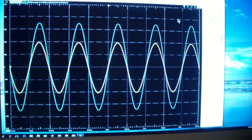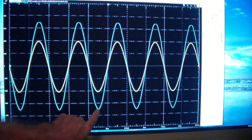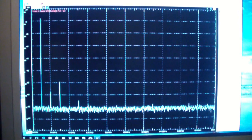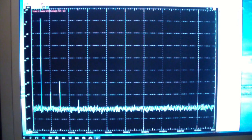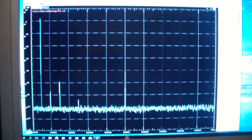Here is the Analog Discovery back to local feedback. Now I'm going to turn on the noise signal. You may notice that the signal becomes a little bit more distorted — you can perhaps see it even more with the peaks. This is a 10 kHz signal. I'm toggling it on and off. Let me show you the spectrum analyzer, where it's a little easier to see the effect of this noise input. This is the spectrum without the noise, and now I've turned on the noise — it's averaging 20 — and you see a pretty good spike at the 10 kHz setting.